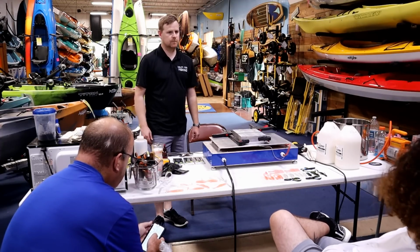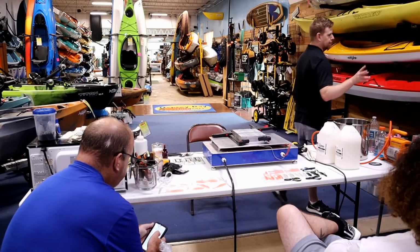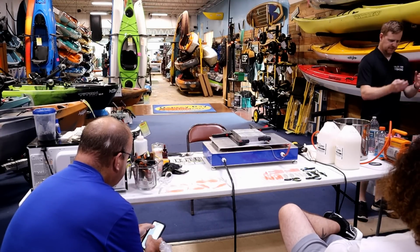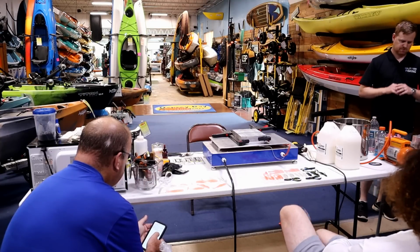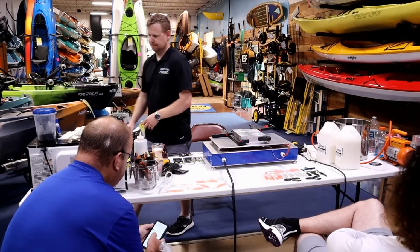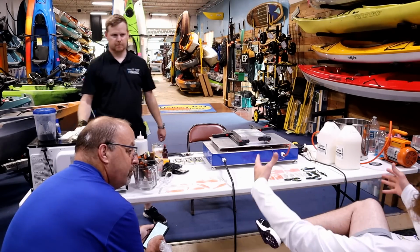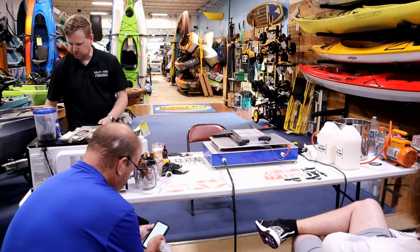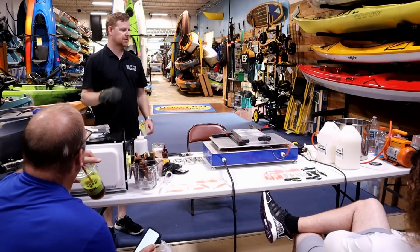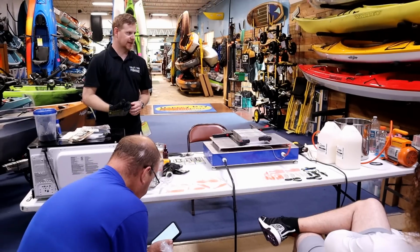Is this about how big molds get, or are there some that are really big? For us garage home do-it-yourselfers, the mold market is such that this is what you're going to see, almost 100% of the time. I know I'm going to make a ton of 4-inch paddle tails, and there's a massive mold that does like 10 or 12. You can probably find somebody who's got a scaled-up version. The bigger the mold is, the more likely you are to run into problems with injection, because the further the plastic has to travel. That's why they're all pretty small.